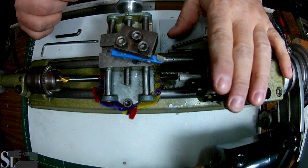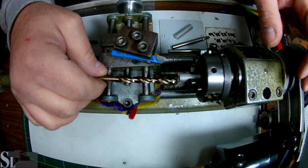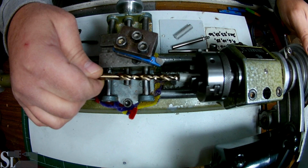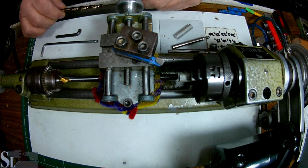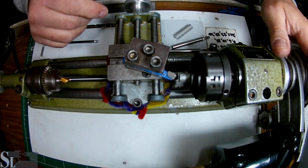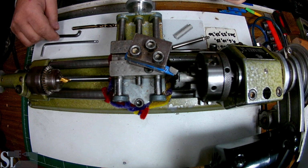Two small issues. Let me take a 6.5 millimeter drill bit and show you the issues. One, if the rotary spindle is going this way, you can drill because the twists are going that way. But if it's going the wrong way, it's just going to scrape, do nothing. Two, this is going the right way, but it's cutting the wrong way, like I'm showing you now. It's not going to cut anything. Again, it's going to scrape. So that's not something you want. Simple solution? Sure. Flip it.